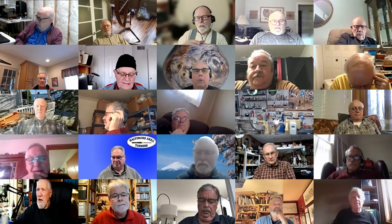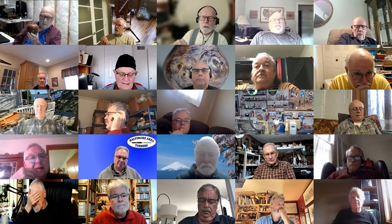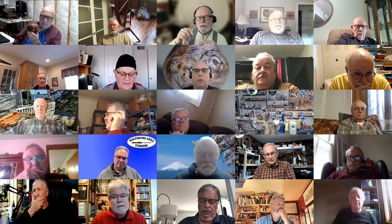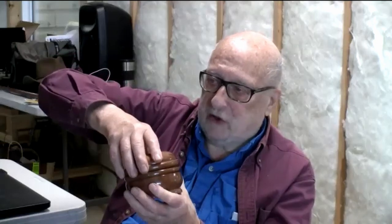On the original fat box from long ago — the magnets are sitting at a set distance from each surface, so when you part it off you're not hitting them. You know how much space you have to work with for the interlocking flange and lid fit. These are not tight fitting lids — a tight fitting lid goes to war with your magnets right away. This wants to be a loose fitting lid that spins all the way around.